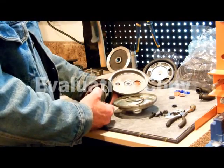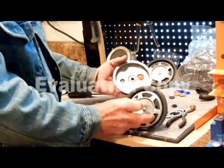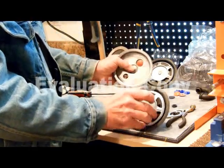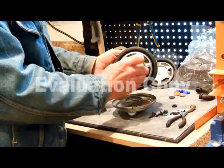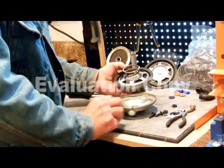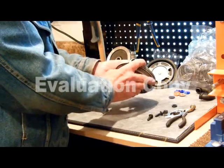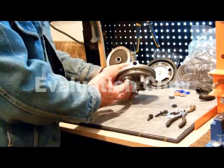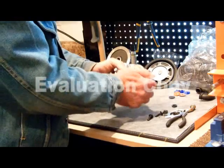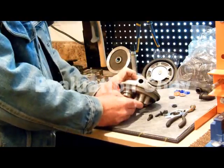Now ready to go back together again after we repair the diaphragm — everything is all cleaned up and nice. Our oil seals are in, our guide is pressed back in, the new valves are in, and we have a little lube in there. We slip the diaphragm back into the lower housing, the new spring goes on top, and the cover goes on. The cover has a line marked to show where it goes so your outlet hose reaches where it belongs. Now we press this together.